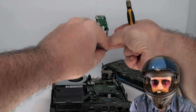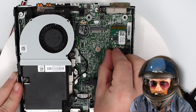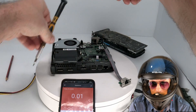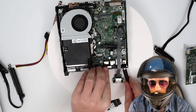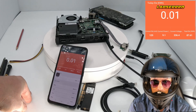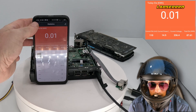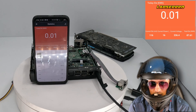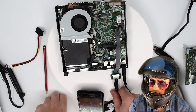Now let's try our next candidate - this 2.5 gigabit network interface card that plugs into the A+E slot. That's going to be really handy for fast networking. It's very poorly mounted here, and I think these are meant to have network cables and drivers, so this might not be a fair test. We'll have to go into the OS and install drivers and actually connect it to something. In the meantime we'll measure anyway, and oh - 9 watts, that's pretty low. Good to see it booting up. Around 16 watts - not too bad, though the drivers aren't installed yet.